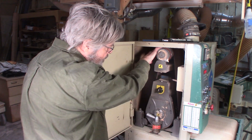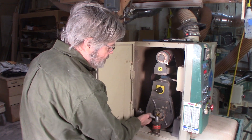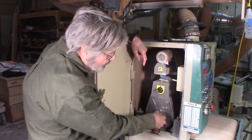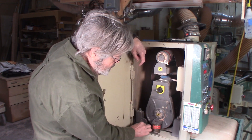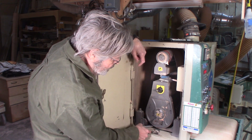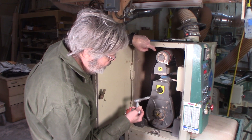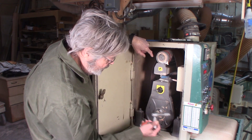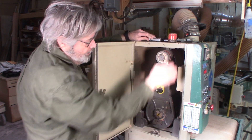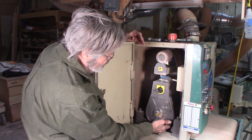To loosen the belt, you turn this — it releases the pressure and it drops. This piece right here is a block and a cam tightener to keep it from lifting up when you put pressure on it with the piece of wood running below. You have to take it off because there's no way you're going to put your belt in there if it doesn't have an opening.